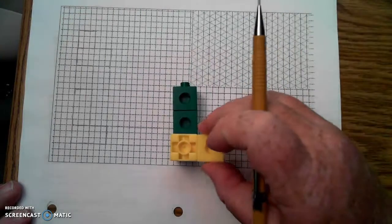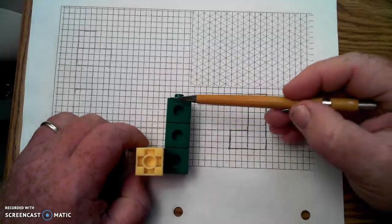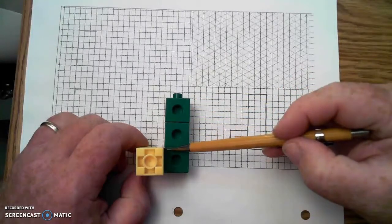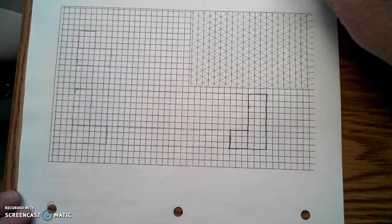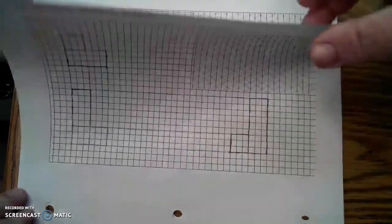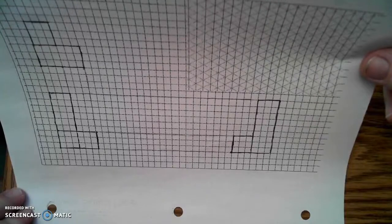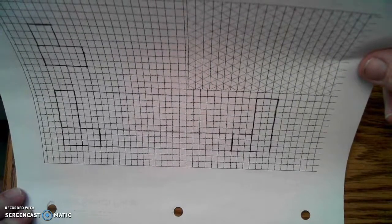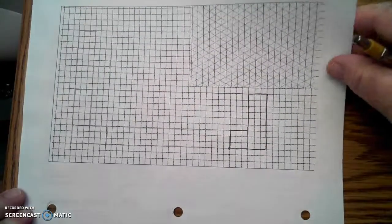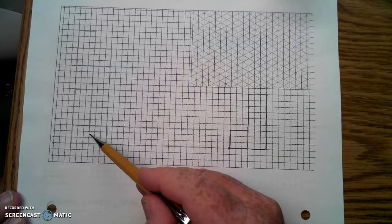One of the other things I want to show you on this particular object: when you go around to this right side view, the edge of that tower continues and runs all the way to the bottom, but we cannot see that when we're looking into the front view. So to show that edge going down, I'll tip this paper up where you can see a little better on the camera. If you can see right there, in the front view, I made a series of short dashes to represent that edge going down to the bottom of the block. And that's how we illustrate those. That is called a hidden line. That means there's an edge there, but it's hidden from me because there's solid material between where I am and where that edge is. So that's a feature that we want to be sure we understand and put in place. So my hidden line is right here.